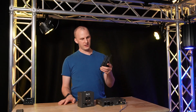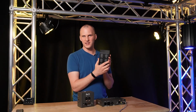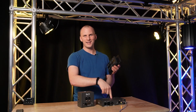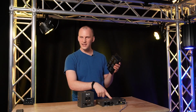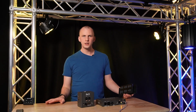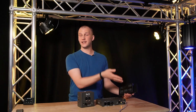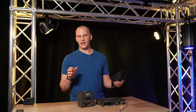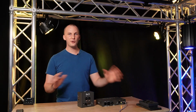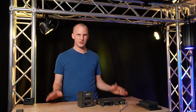But that's a really cool use case because the DMX programming inside the B stations is a little limited. It doesn't have the memory, doesn't have the processing to do a full DMX store, but the EN4 does. And so you can actually have this button station fire cues in this EN4 to be able to get a number of different looks. And maybe if you're in a restaurant or something like that, that's going to be all you need day to day. But then you bring in a band, you've got somebody running audio, they can have a lighting console and actually trigger stuff. So that's where the cues, again, can be really powerful. You can essentially do, with other devices, some house light control and stuff like that, all without getting into an architectural lighting system and all that jazz where it starts to get more complicated.